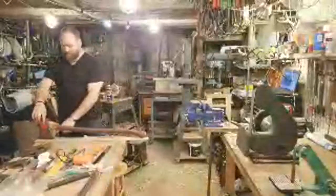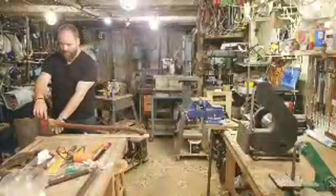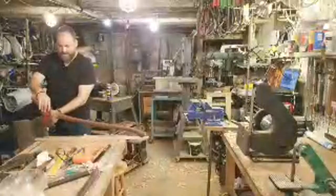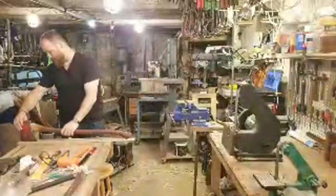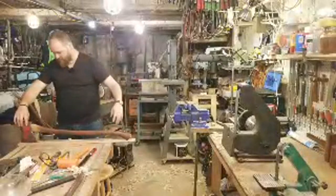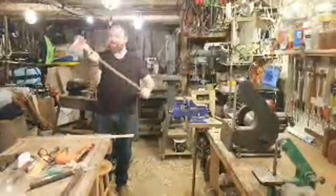All right. So when you put your bit down on a table where the handle touches, you usually want your cutting edge to be sitting about right in the middle. Now, this is just a smidge low. I'm just below halfway, so it's touching about here instead of in the middle, which means I need to tip that axe head back some so that it straightens up and rests more in the middle. Now, this is pretty close. It's not bad, but actually that means it needs to go forward more. Oh, right. So I'm actually probably okay. It might also depend on how much your handle is resting, but it's actually not bad. With the way it's going, it's telling me that I need to tip it further forward, but I don't want to go too far forward because then it's just going to look kind of funky. So I think this is looking really nice.